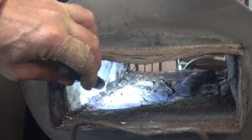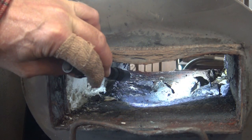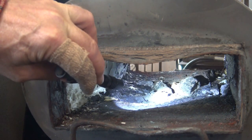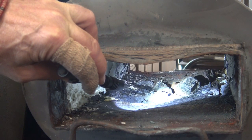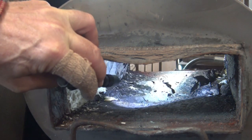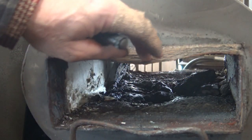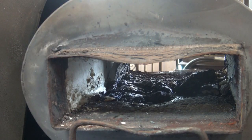Kaowool gets eaten up really fast by forge welding flux; hard ceramic board gets eaten up. This is a cast ceramic of some sort in the bottom of this forge and I try not to weld right on it, but eventually welding flux finds its way down there and I'm going to have to reline at least the bottom of this forge very shortly. You can see up here where this door has sagged because of high heat — because I run it at very high heat to weld, and if I'm running at lower heats it never does that.